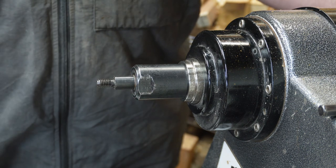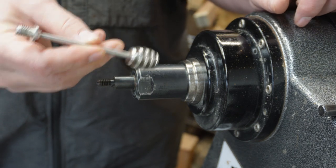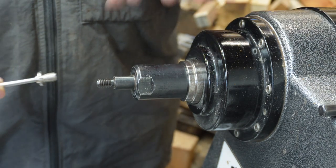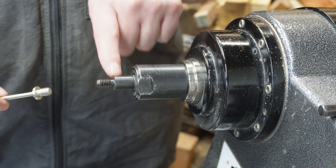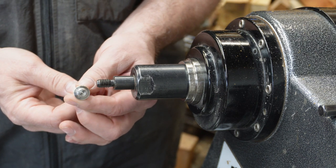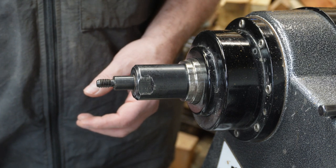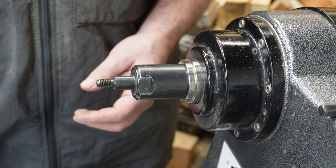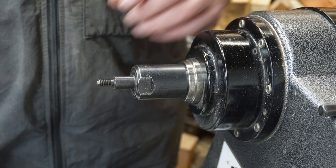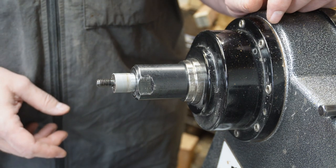This post is the same diameter as this end of the Stainless Bottle Stoppers stainless honey dipper. So if you screwed on a piece of wood and turned it down to this size, that would match up exactly with this honey dipper size for the metal end. So what Stainless Bottle Stoppers did, instead of making a whole bunch of different mandrels, was take something from the pen turning community and come up with bushings that fit on their mandrel.